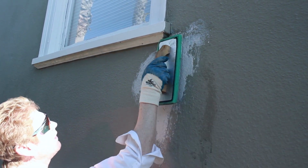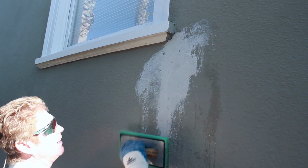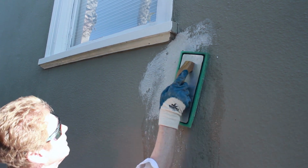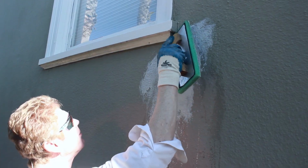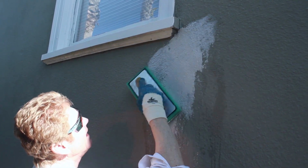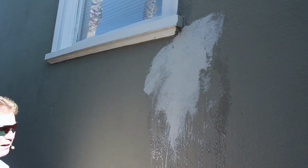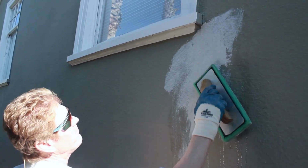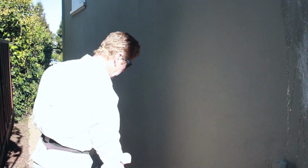And it's okay for a crack, but when you have something this large right here, it's not going to match the surrounds. So even if I bring out the aggregate or the sand that's in this caulking, it's not going to be perfect. But for a super hairline, the caulkings with, say like Mor-Flexx, it has the sand in it. It's perfect. But for a bigger one like this, what I'd recommend is go to Home Depot or Lowe's, guys,